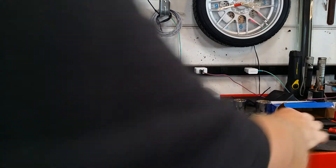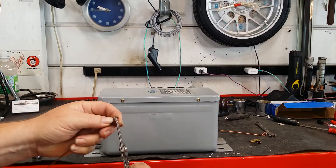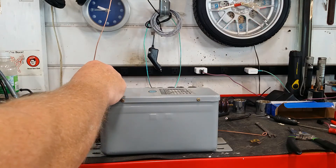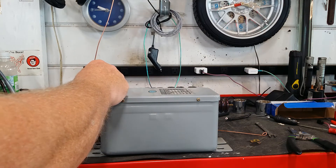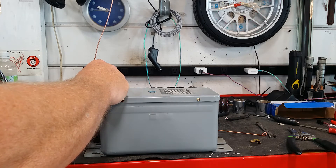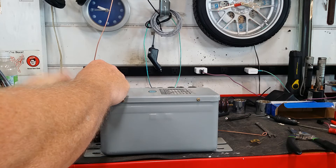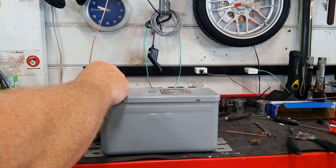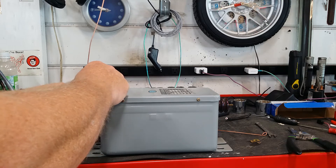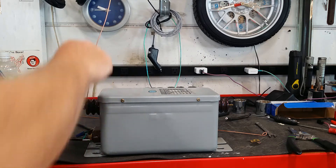It's a little tight — let's loosen that up just a bit. Try again. Put a washer and a nut on so we can get it good and tight. You don't want this wire getting anywhere near the case of the transformer either, so we've got to make sure we give it some room.